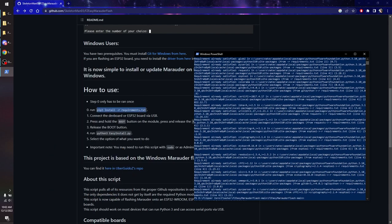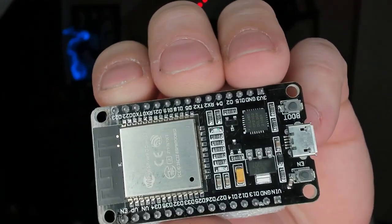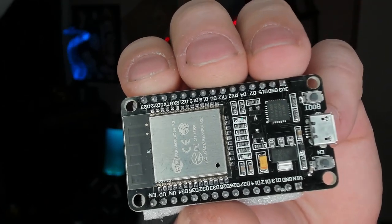I've already done this before so it's a little faster. However, the first time you run Step Zero it may take a few seconds, but not a big deal. Now we're going to go ahead and plug in our ESP32 holding the boot button — I'll show you how to do that just in case. So this is my ESP32. As you can see, there's the boot button. We're going to take our USB cable, hold the boot button, and plug that sucker in.